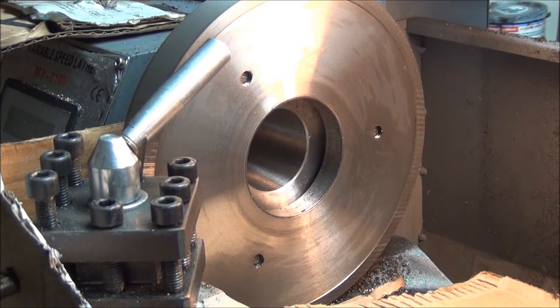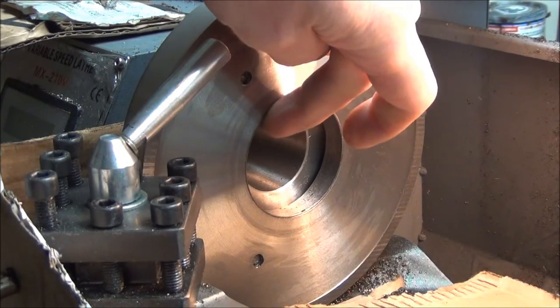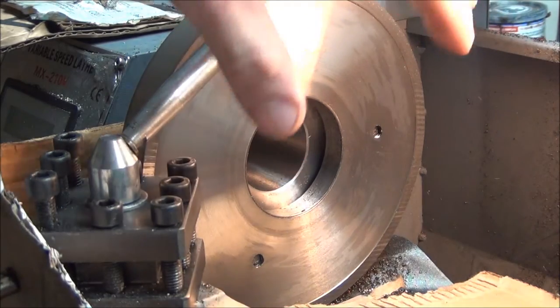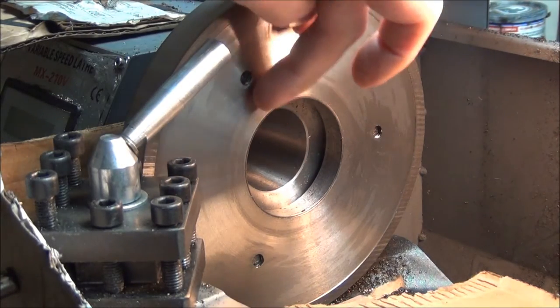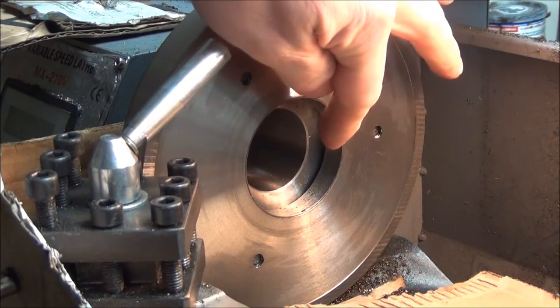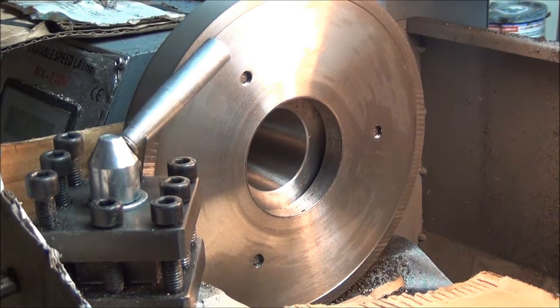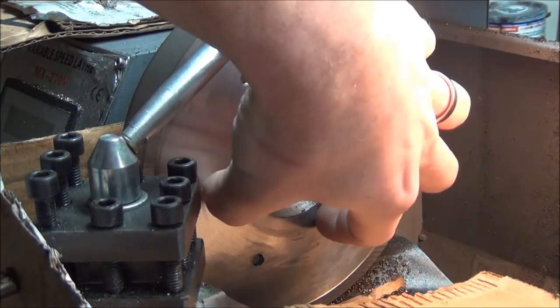It's horrible. What I started out with was this plate chucked into my three-jaw chuck, and I'd already cut out this intersection with just a hole saw, mounted it up onto my three-jaw, and cut a register that would fit the spindle of the lathe, and it is 95 millimeters.